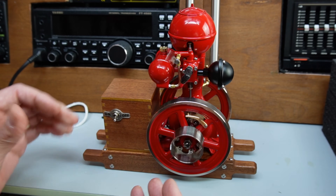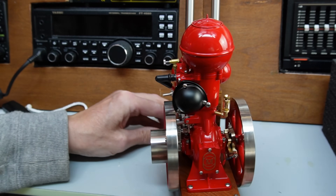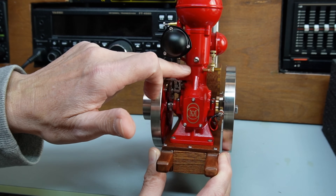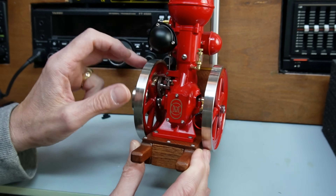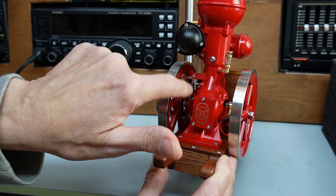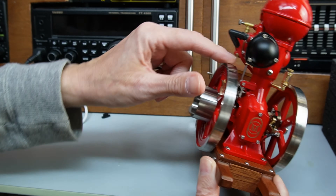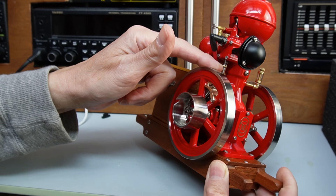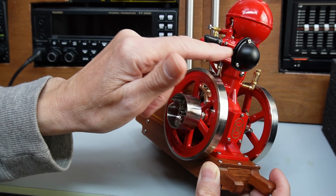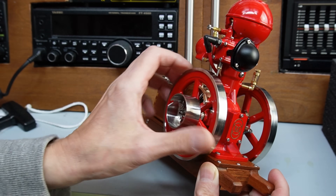Of course they were superseded by diesel engines that were cheaper to make and buy, but this one is really nice. It's heavy as well. Got an oil-feed system here that goes into the cylinder to keep it lubricated, and here is the gearing system — this will be for the speed regulator, which controls how the engine misses. And there you can see that — that would be the exhaust silencer there, and that would be for the exhaust valve.